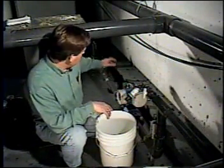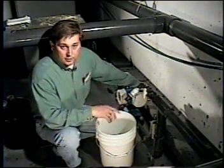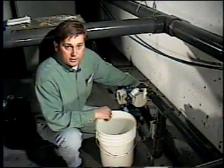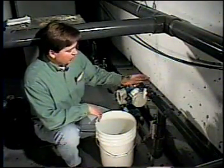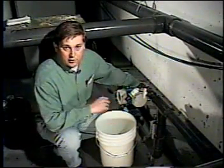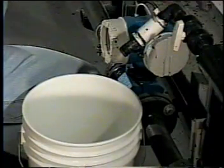When we decant the water, we monitor the turbidity, the pH, and the flow. This is all recorded for the purposes of plant records and to report to the city. We also have a sample tap here, which we'll open and check the clarity of the water coming out of the system when we decant in just a couple minutes. Now we're going to check the clarity of our discharge.